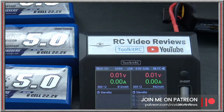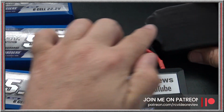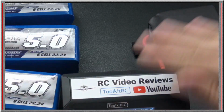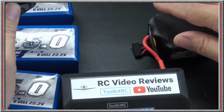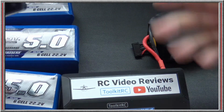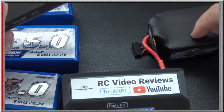And then same with your voltage. If you're using this battery as a power supply, you notice how I cut off the video. I said, okay, that's enough. Well, when I did that, I was at 3.3. That's the low watermark. You don't go below that. I kind of knew when to stop, just because I understand these things. So I stopped it, but that's it.